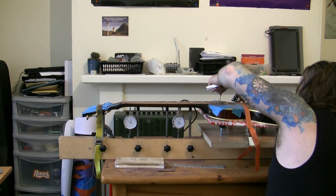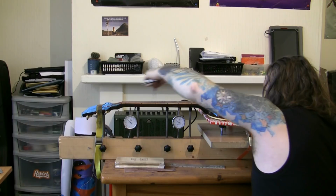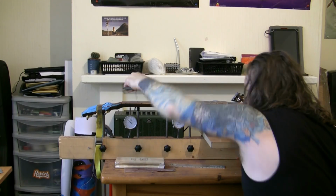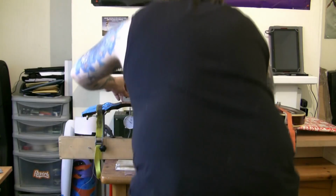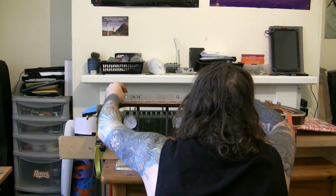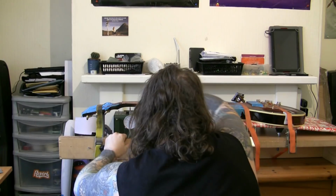And we are getting there. We're still a bit high. We're being a 12 radius, we're making the fingerboard a little bit flatter. Like I said, we are getting there, but it's not ideal. You can see how much material I've actually moved at the moment. Now we've got the neck still level, still straight, which is good. So I'm going to carry on doing this, and I will come back nearer the time.